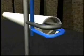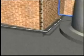The desalinated water and the salt water concentrate are now separate streams. They flow to the end of the membrane element and are collected into separate manifolds — a desalinated and a concentrate manifold. The concentrate is typically sent back to the ocean utilizing diffusion techniques, while the desalinated water is stored and repressurized for distribution as drinking water or plant makeup water.